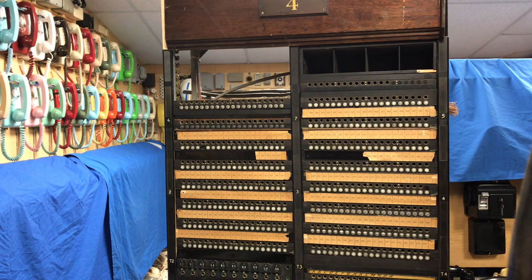The 100-year phone call will be stepped through the different vintages of technology, and none of the technology has been modified. The magneto phone will be as it was when it left the factory, and the switchboards are all built as they left the factory. The trunk to the Asterisk system is an analog trunk to a channel bank, then T1 into a modern PC with an Asterisk platform. From there it will go VoIP out to the network and then into the cellular network, or I can also call landline phones.